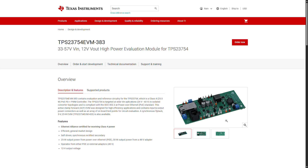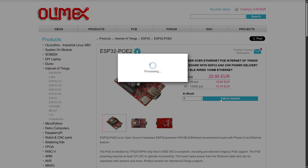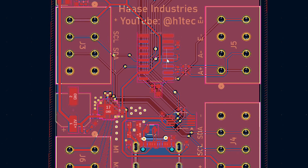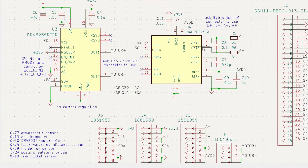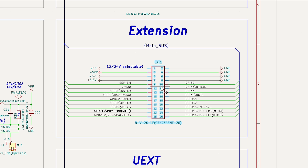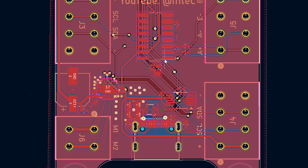Now for the PCB — I could have made a custom PoE Plus design, but look at this thing. It's nasty. And without much prior research, I was afraid I'd mess something up or just not be able to design it quickly enough. Because there's no point if I don't actually understand how what I made works. So I just bought the ESP32 PoE2 from Olimex and made this add-on PCB for it, connecting with a ribbon cable, which could help it cleanly interface with all the sensors and be programmed while powered. It turns out the ESP32 PoE2 has literally like three signal wires free, so I managed to cram all seven sensors onto the same two wires when it usually would have taken seven or eight to do the same job.